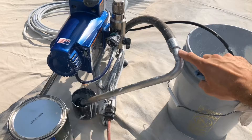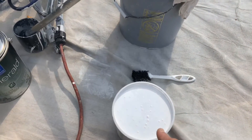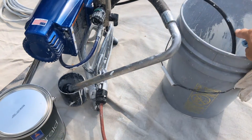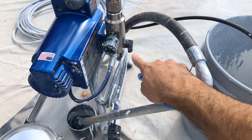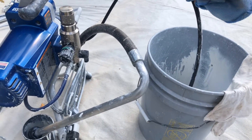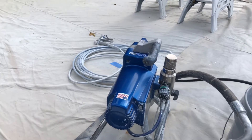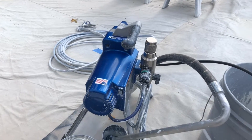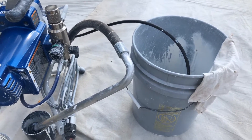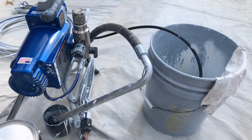What we have to do now — remember there's water in the hose and in the priming tube. This will go in the paint, which has been strained. We'll push all the water out first on the prime setting, which is vertical when the tab's straight up and down. Once we get paint coming out, shut it off, then cycle paint through the hose. Once it's loaded, spray all the water out, get that first bit of paint out which will still have some water in it. Then once it's thick enough, get your spray pattern dialed in just like with the primer where it fans out on the side.